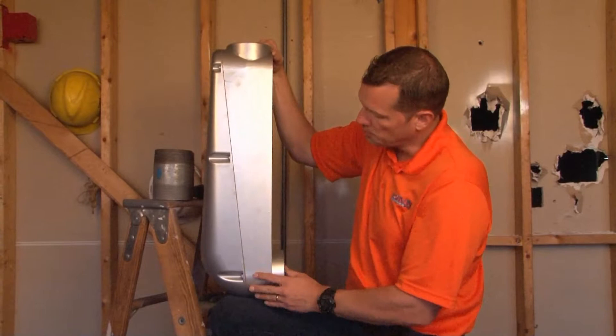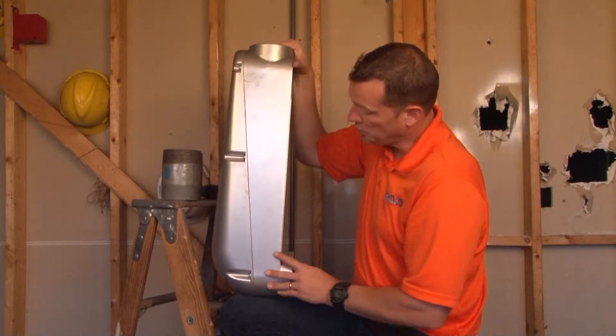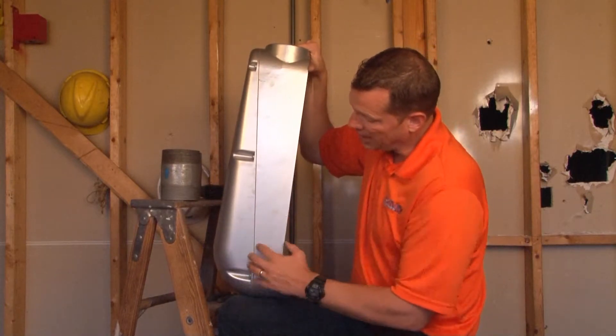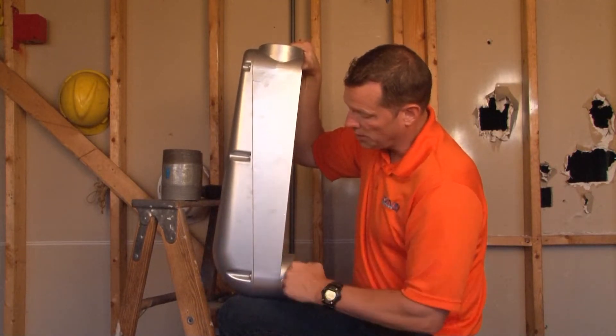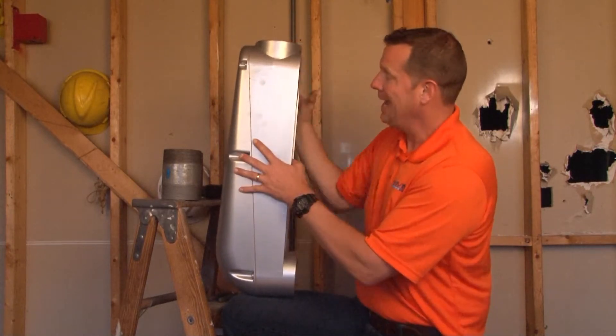As you can see, we have a large body that is premium powder coated. What's unique about a mogul conduit body is that it has an angled cover, which creates lots of extra capacity within the body for wire pull and looping where it's most difficult to bend in a standard conduit body.